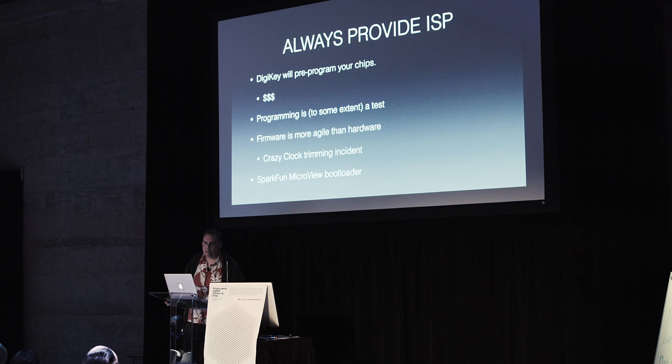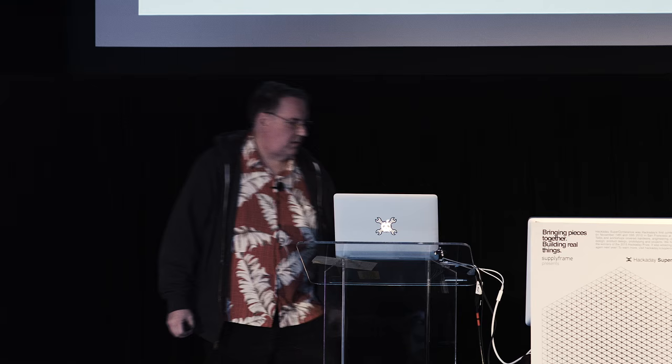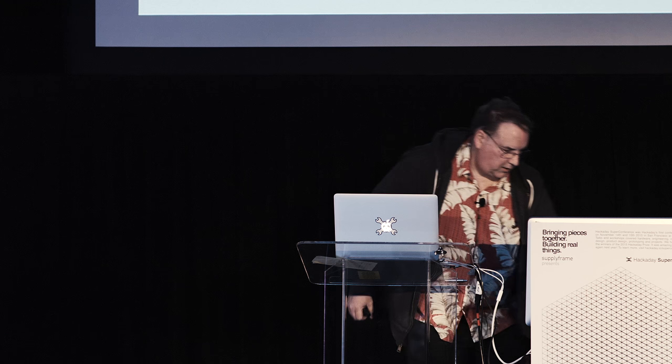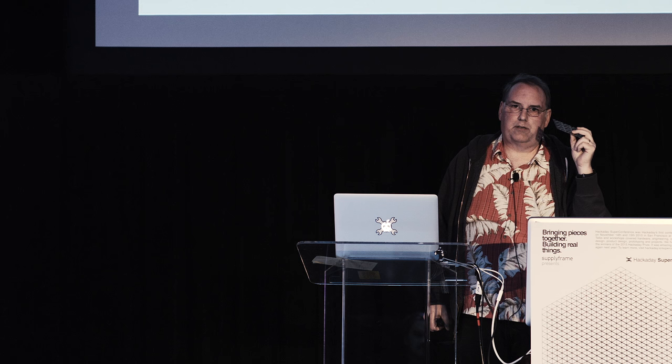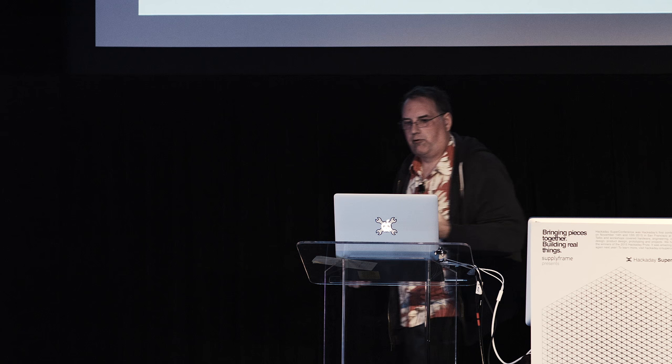So that's really about all I had prepared so far. My vendors that I really like, I've given shout outs here. MG Circuit, you may not have heard of. They are the people that I went to get these boards made. The Crazy Clock, I could only get them made with 1 millimeter thickness, which OSH Park unfortunately wouldn't do. They don't have multiple thicknesses yet. So they wound up doing a really good job, though. I'm very happy with them. Some of the fabs, like Dirty PCBs, they have idiosyncrasies. This is another thing to watch out for, the idiosyncrasies of your board fab.